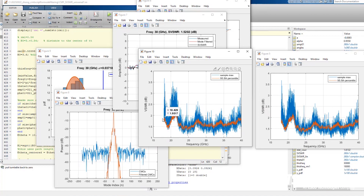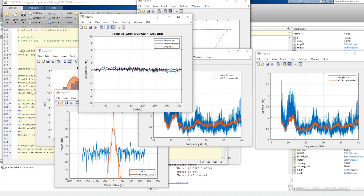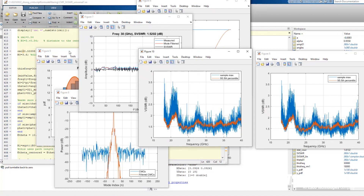In the background you can process all these frequencies one after the other and get a curve of the VSWR results. This is a very robust VSWR — as you can see, the jaggedness is much less than using the actual max and mean of the curve. The other way to do it is to find the maximum peak and mean and calculate the VSWR, but that calculation is not as robust because catching the peak or valley is a statistically rare occurrence. Using the whole distribution of the population to calculate the VSWR — which is the red curve — is a lot more robust than using the blue curve, which is the instantaneous max-minus-mean subtraction.